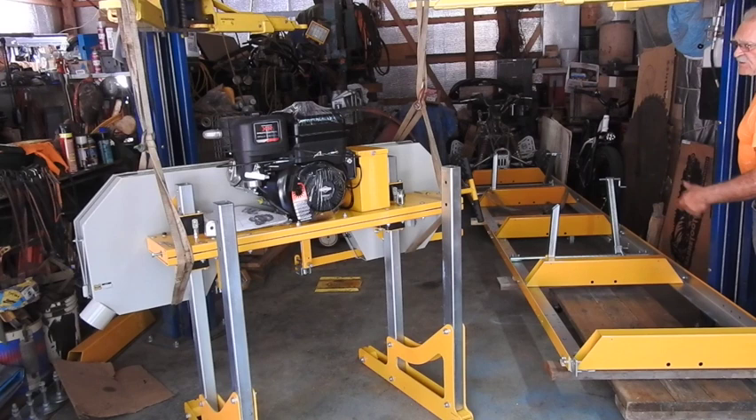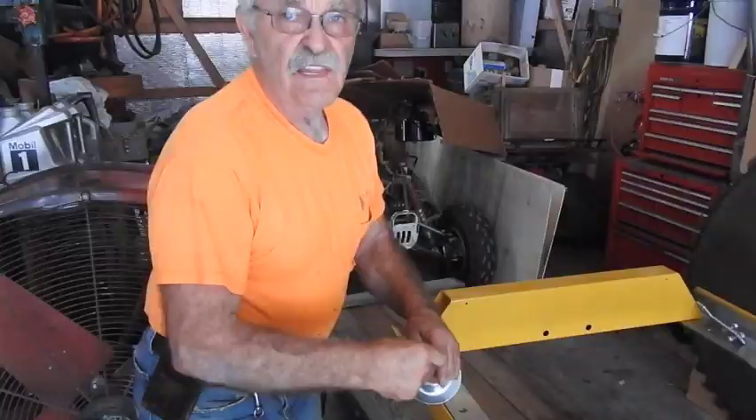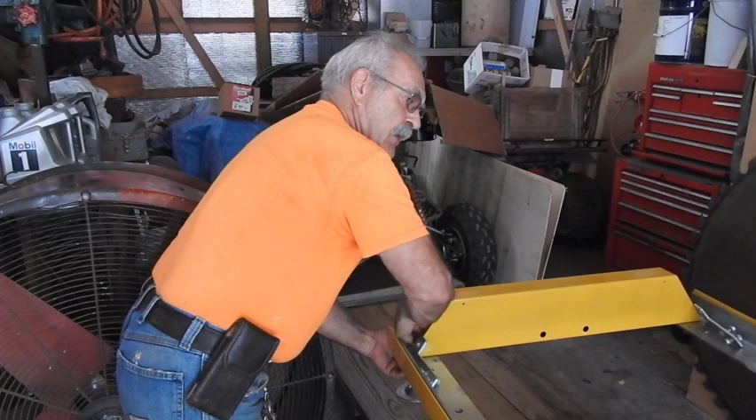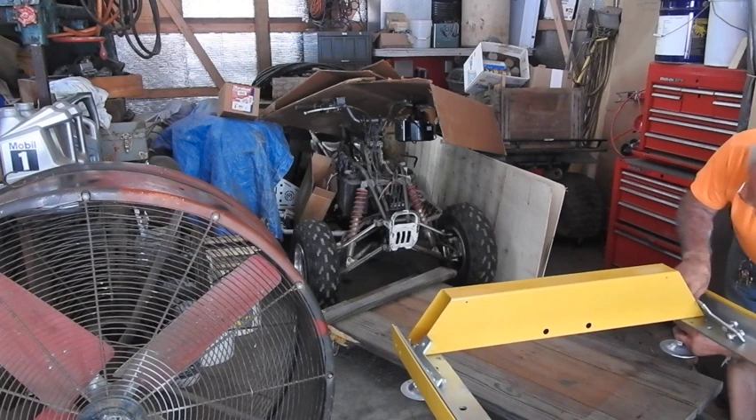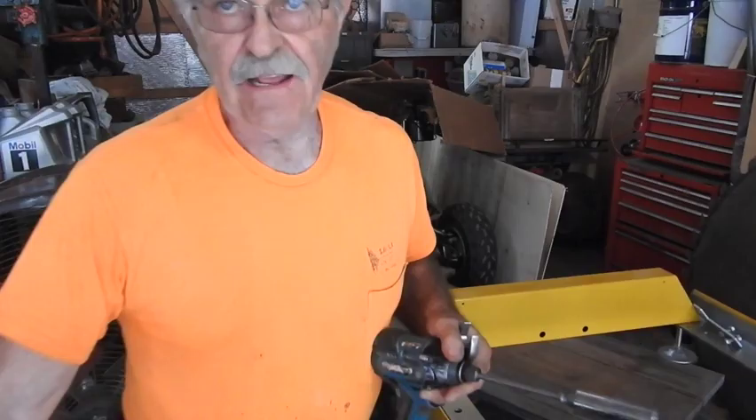I've already got it on, so I'm going to lower it. I'm going to go ahead and disconnect it and we'll figure out what the next step is going to be. This is typically one of the leveling blades — I think there are 10 coming with the original twin 84-inch sectionals. I've got a rudimentary adjustment to try to get them set at about the same level for whenever I set it back on the ground so I've got a close starting point.